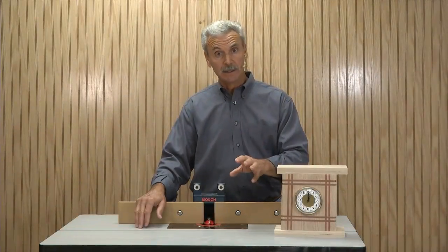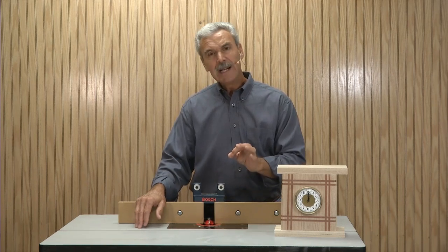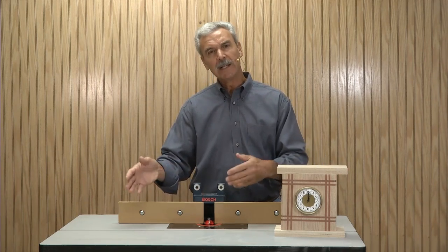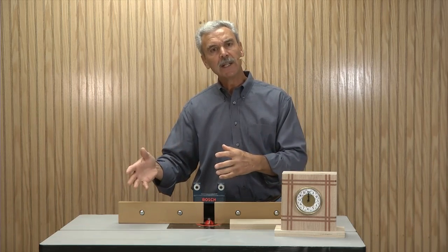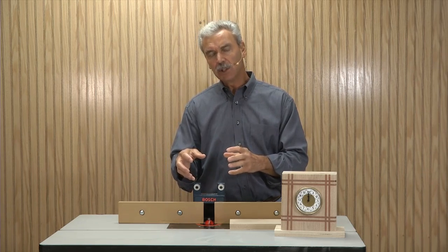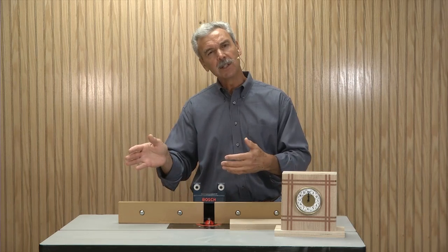So we've talked about the bit and how sharp it is. There are a couple more things you need to know before you go to the router table. The first is the bit's speed. The diameter of this particular bit is about an inch and a half, which means I can run my router at about 20,000 RPM — that provides plenty of speed for a nice clean cut. The second thing is the feed speed. Taking this piece of wood and passing it in front of the router bit takes a little finesse. Running it too fast means the bit is going to work really hard, and sometimes that can lead to chipping. Running it too slow means the bit is somewhat freewheeling, which can provide a little heat and cause some burning.